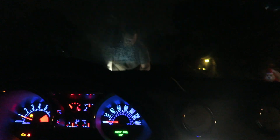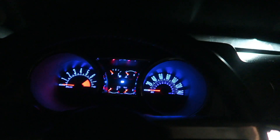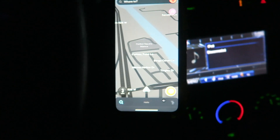So now it's reading a little bit low, so we have to adjust it just a tad — it's about five miles an hour off, so we're going to try and fix that. All right ladies and gentlemen, we got the speedo to work. So this speedometer — we have the GPS speedometer right there and this is our actual one, and it is reading correctly now.